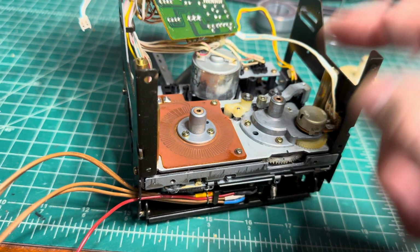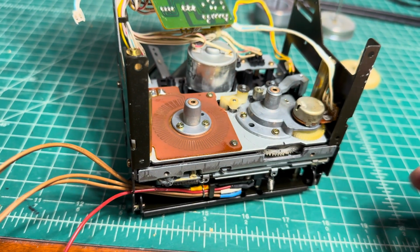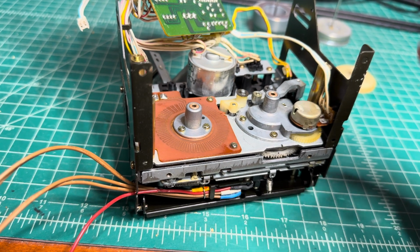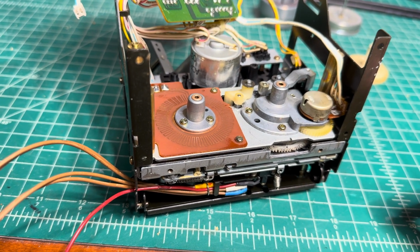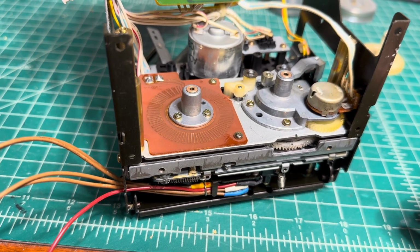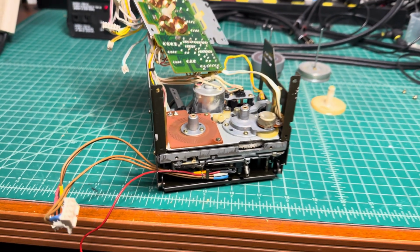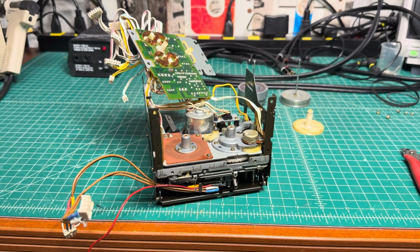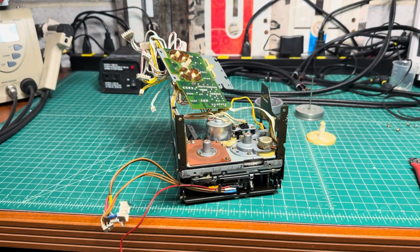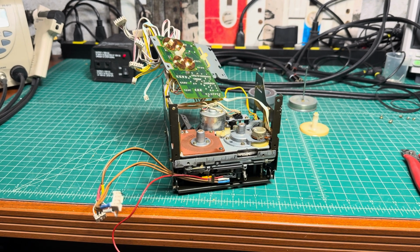So I removed the capstans, and bearings are super dry. Like when you remove it, you just can feel that it doesn't go easily, and it's just bad. All right. So let me continue assembly, and then we will close from the back and open from the front to replace idler tire. See you soon.